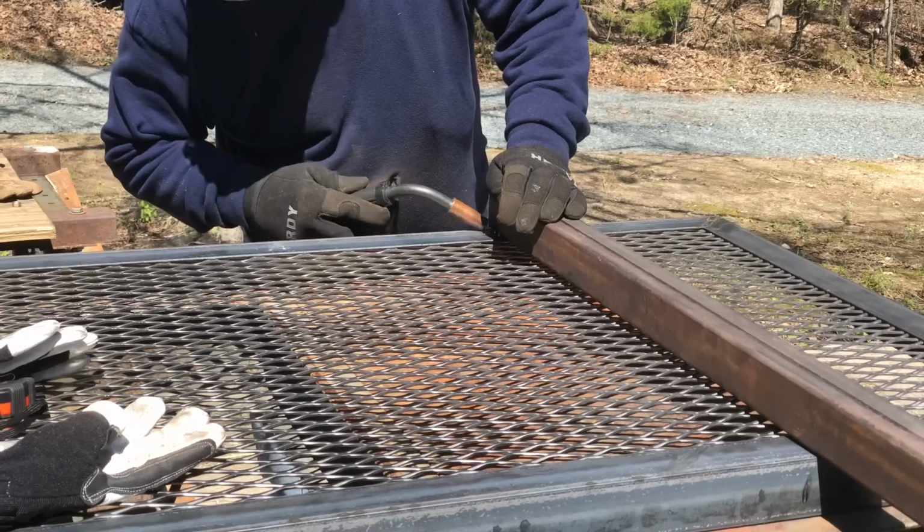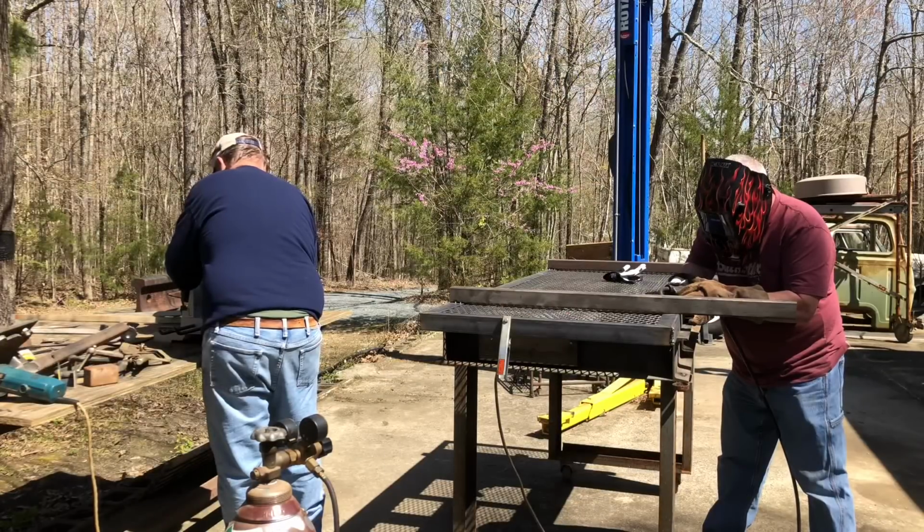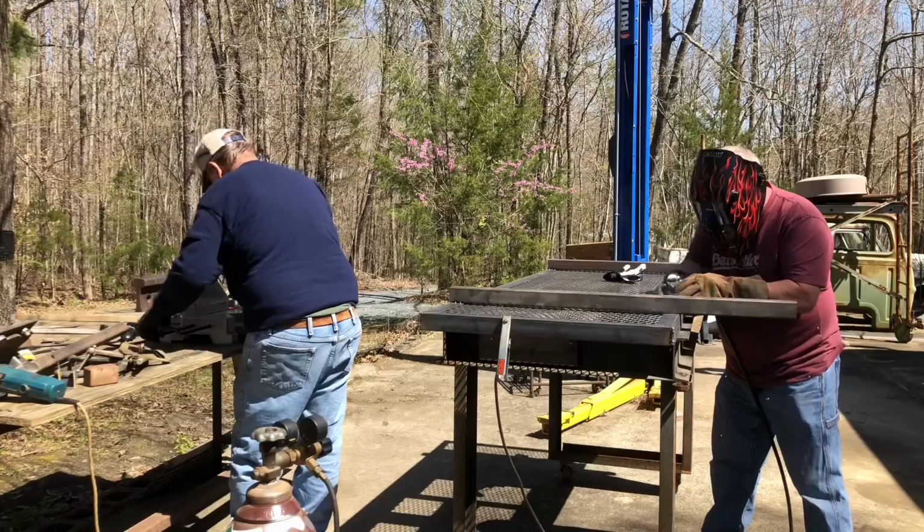We positioned the tubing so that it set in from the end of the rack 11 inches on each side. This allowed me to attach the receivers to the strongest points of the bumper, which is right up against the frame.